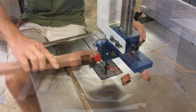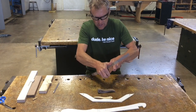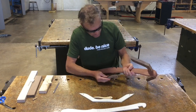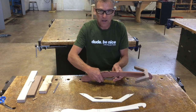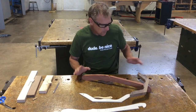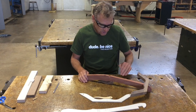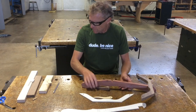I've got my stock, my bow that notches in here — this is kind of like a cross-lap joint — and then I've got my trigger which is going to go somewhere right here. Before I put this together, I want to go to the belt sander to sand the edges, then to the router to soften the edges everywhere, especially where I hold it and on the trigger. I have a few more parts to cut out.